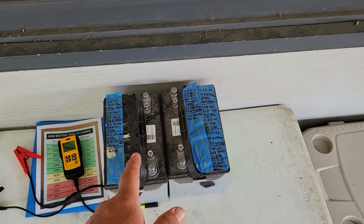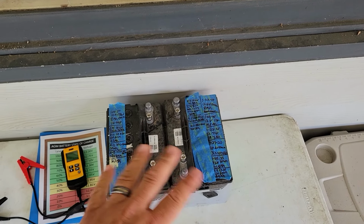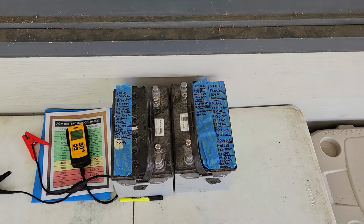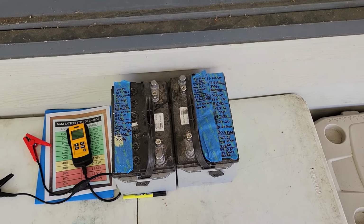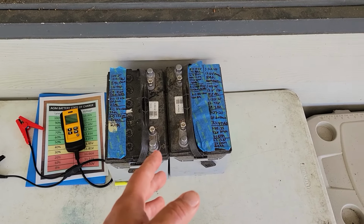This is not like a lead acid battery where you bring it all the way up to like a half inch at the bottom of the hole. No, this is just to get those mats wet again. They need to be wet. So you can do that. I personally used reverse osmosis water. I did not use distilled water, and the reverse osmosis water worked just fine.